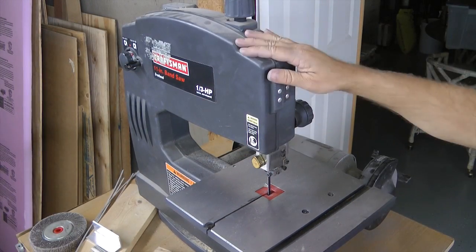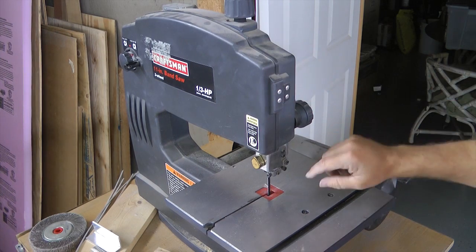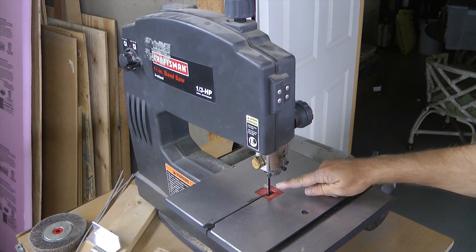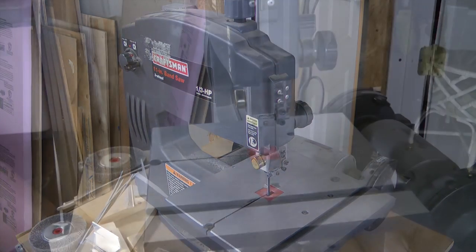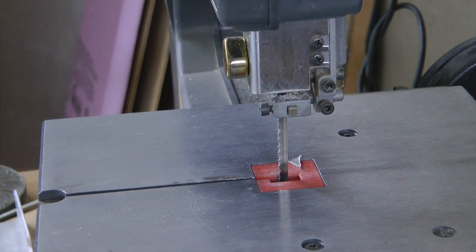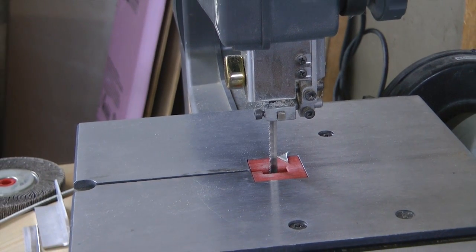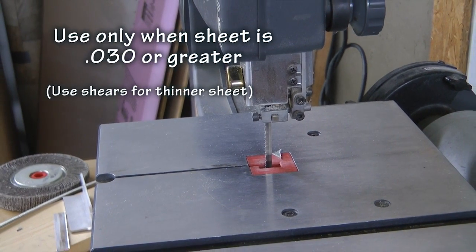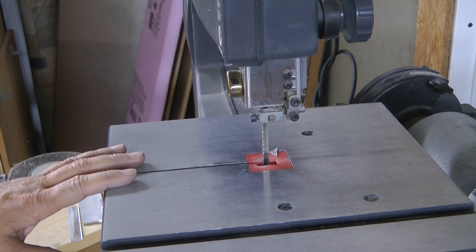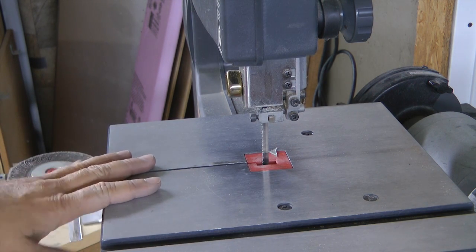What tool do we have here? This is basically just a woodworking type of bandsaw, variable speed. The important thing is I am using a blade made for non-ferrous metals — I would never try to cut steel with this. The blade is very narrow, and just like in woodworking, that very narrow blade allows you to scroll through tight turns very nicely. My rule of thumb is I wouldn't use this on metals thinner than about 32 thousandths — your hand shears will work just fine. But 32 thousandths and up, like your 40 thousandths and 60 thousandths, this works very nicely, just like a piece of quarter-inch plywood navigating through a thin blade.